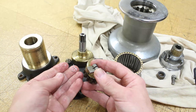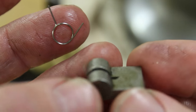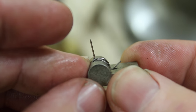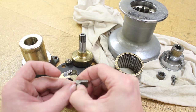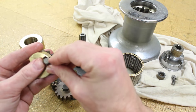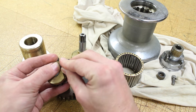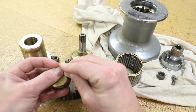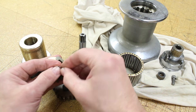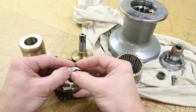Here you can see again the shorter straight edge and the longer bent or angled edge. You'll want to place the short edge into the pawl just as you see there. Once it comes time to put things back together after you've cleaned all the parts really well with a toothbrush and kerosene, it takes a little bit of fiddling — it can be beneficial to use a small slotted screwdriver or other pointy device to help hold the spring in place while you slide the pawl back into the assembly. It took quite a bit more fussing than I wanted, but sometimes that's the nature of the beast.